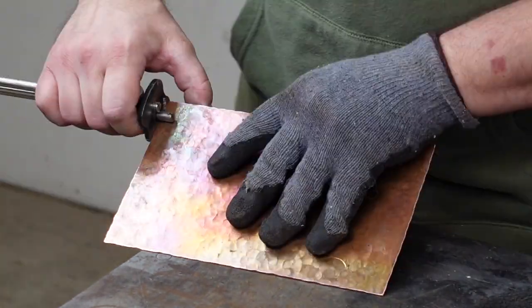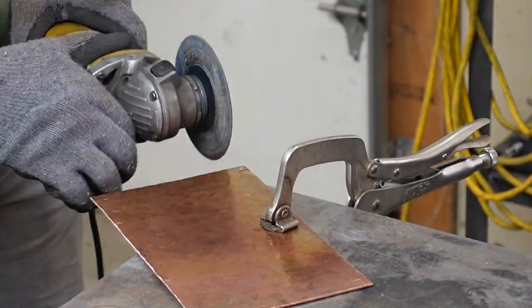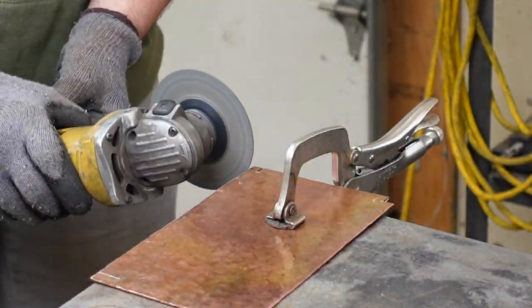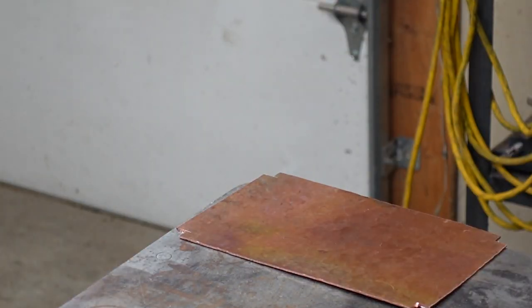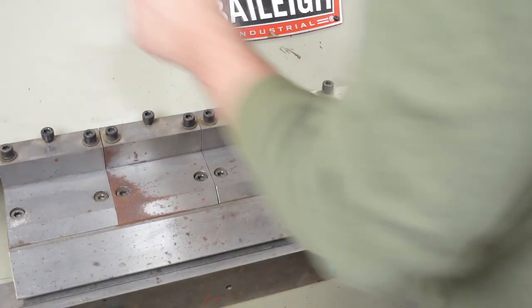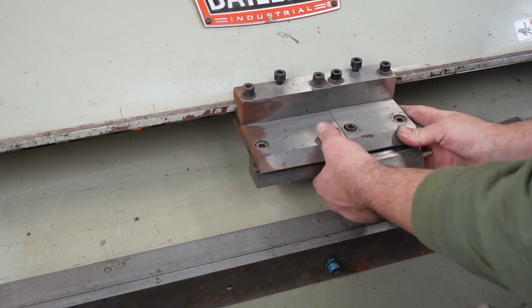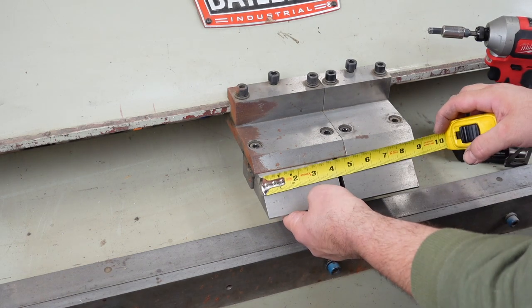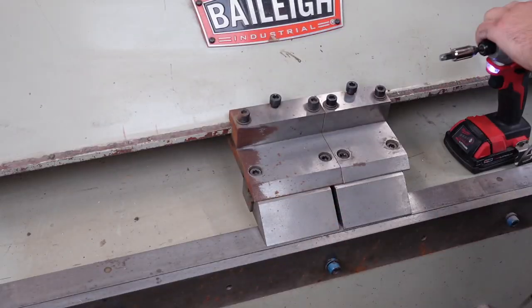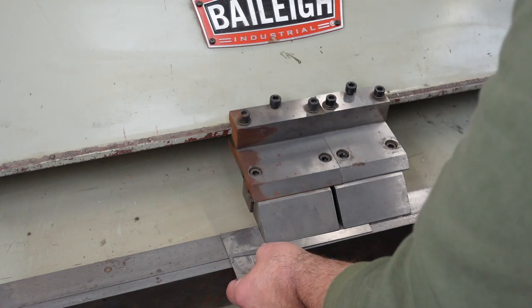After measuring my blank out, I'm going to set my scratch gauge to mark the corners and then I will notch them with just a regular cutoff wheel to get it ready to be bent. Right here I'm going to remove some of the dies on the leaf brake and put in the exact measurement for the long side of the lid. That way I can go ahead and break the small side of the lid first, bend those up, and then it should fit right inside in between the two flanges to do the long side.